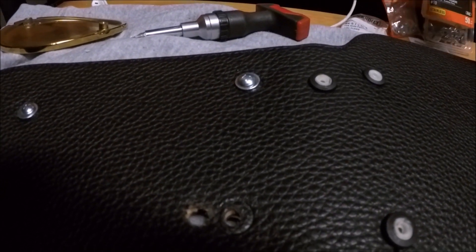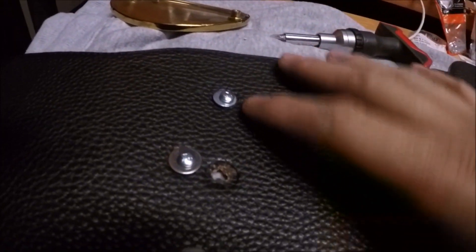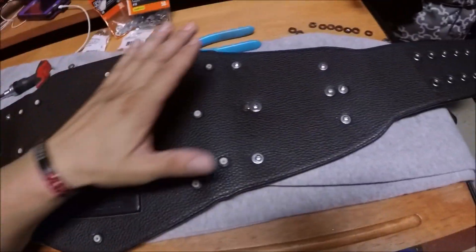Get 16 of these — number six is the perfect size. I got number eight washers; to be honest you could probably use the same washers from the universal one to save a buck or two. All you do is put the screw through the washer, put the screw inside the little rivet, and start screwing down. Make sure you get it snug and then just a quarter turn after that — you don't want to tear through the rivet. You're making threads on the inside, but if you keep turning trying to get it super tight it's just going to rip it. Get it snug, a little turn, and that's it. You'll have five screws for the actual plate and two for the side plate.